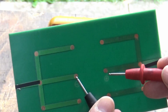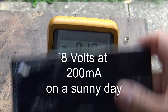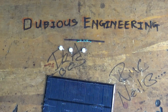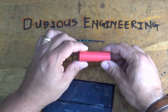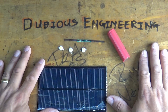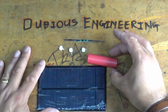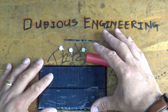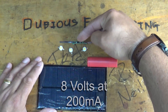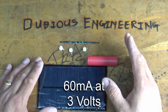So the plan - I'll just take this outside. In a cloudy environment it's pushing about 7 volts, that's not bad. Here's the BMS, here's three LEDs, and here's an 18650. So: 250 milliamps, 8 volts, charges at 4.2 volts maximum. Even on a cloudy day this should be producing more than enough drive to charge the battery through the battery management PCB. These LEDs consume about 20 milliamps each when in series with a 22 ohm resistor.